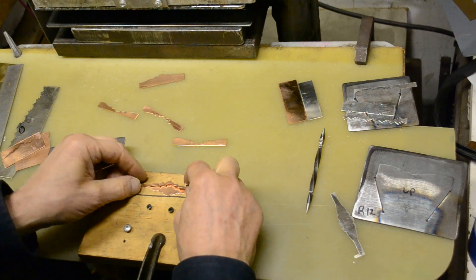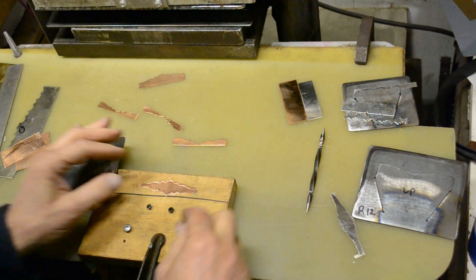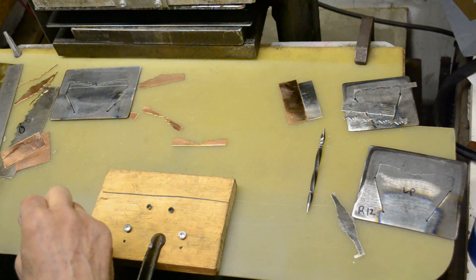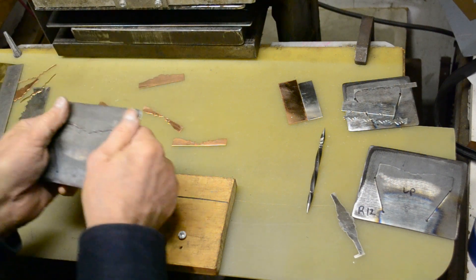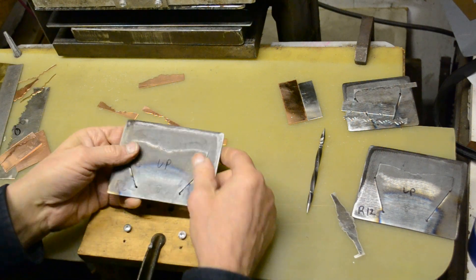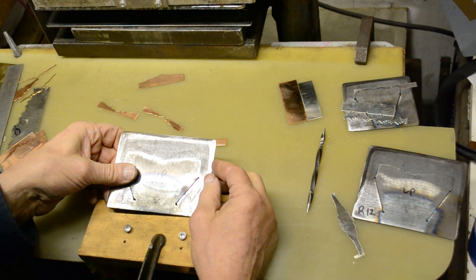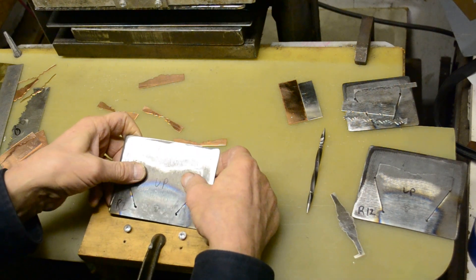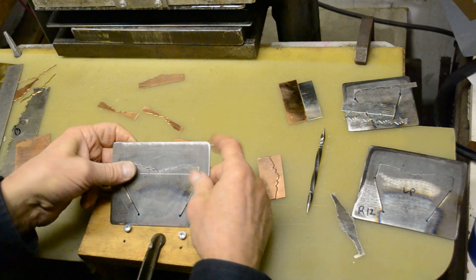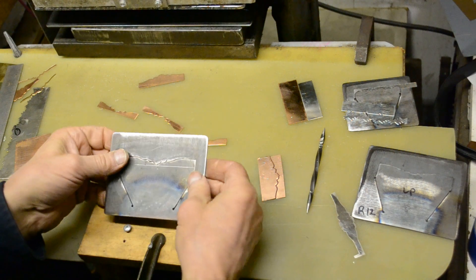It's really easy to make a little ring shank with a nice border like this — there are a thousand other things you can do with them. For embossing: if you're going to try to emboss with one of these, use thin metal — don't go thicker than about 22 gauge. The die has to be open in the opposite direction from when you're loading metal in to cut it, so you'll have to open it up backwards.